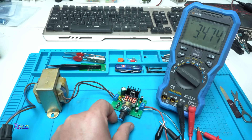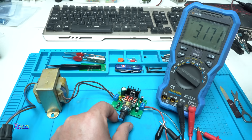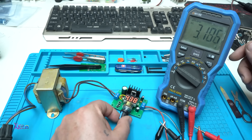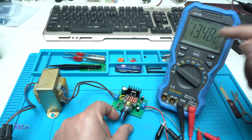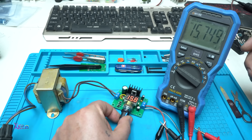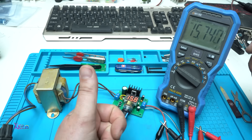Let's change to 3.4 — the multimeter reads 3.2 volts, and the LED voltmeter shows 3.171 volts. It's close. At 13.6 on the LED voltmeter, the multimeter reads 13.4. And the maximum: LED voltmeter shows 15.8, multimeter reads 15.7. It's all right, I like it.